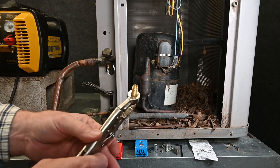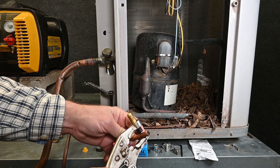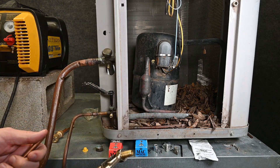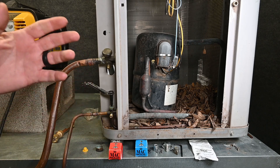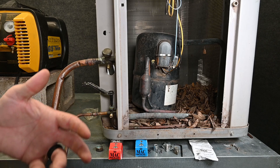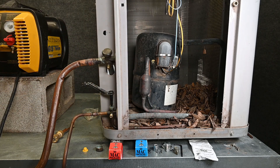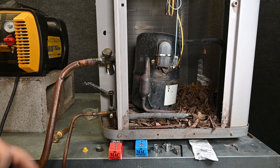If this is the method you're going to use, I strongly recommend that you practice on some regular copper first, making sure you get the right amount of tension. Sometimes it's too loose, sometimes you put it where it's too tight and it crushes the copper, and the little rubber seal doesn't make a good connection. The very first time I did this, I clamped down on the copper, had it too tight, it bowed the copper, pinching it, and it blew all the refrigerant out. Now if that happens, it's simply an accident. If you don't do it on purpose, it's an accident - it's okay, you're not going to get fined. What you want to do is vacate the area immediately. Refrigerant displaces oxygen, so if it gets in your lungs it's going to make it very difficult to breathe, as well as other health effects from breathing in a chemical. So if the refrigerant starts shooting out and oil's coming out, just get away from it. Evacuate the area so that you're not breathing in that chemical, especially if it's in an enclosed area inside a building where the refrigerant can't be blown away by the wind.